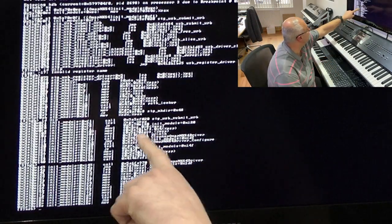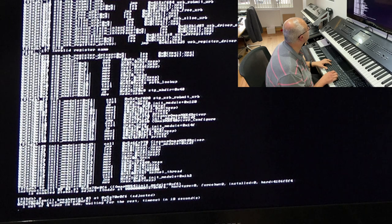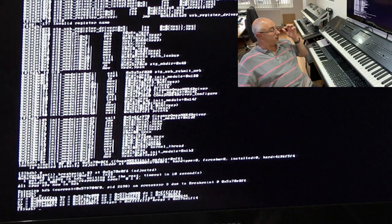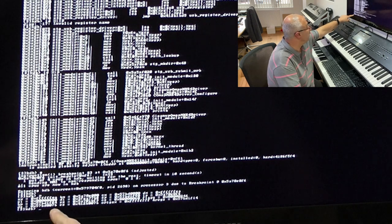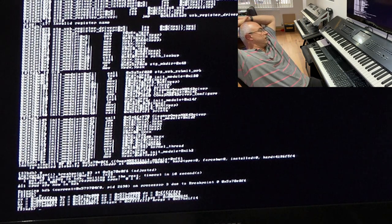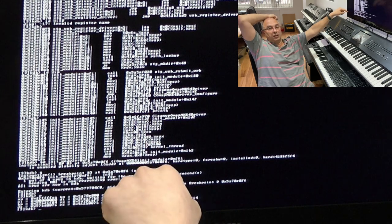So we are here, and I'm going to break that down to F6. This is where the error is. You see now what happened? It just tried to register the URB, but AX came back with a minus 16 error code, which is EBUSY. Sorry, minus 16, not minus 6. So the code is error 16, or minus 16, and because of this error, this whole thing will not work. It will stop and give you that error.